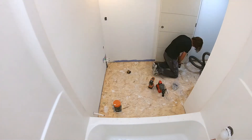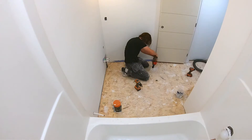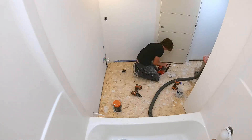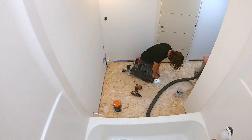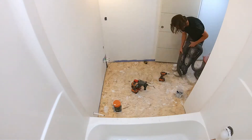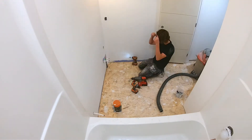As per DryCore's recommendations on their website, for any tile that's going to go over top of their insulated panels, they are recommending that you install five fasteners into the concrete per panel. This is quite a bit — there are a lot of fasteners. For the fasteners, I'm using Tapcon screw fasteners. They are two and three-quarters of an inch long and a quarter inch in diameter, which allows roughly two inches of embedment into the concrete and holds these panels really tight to the ground.